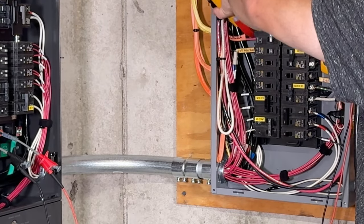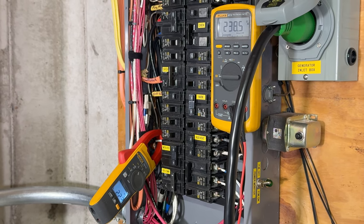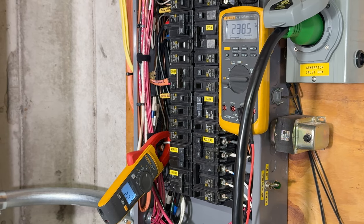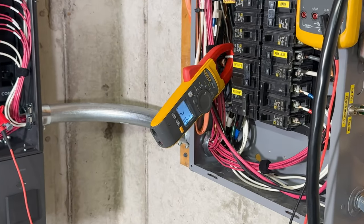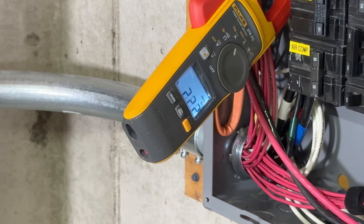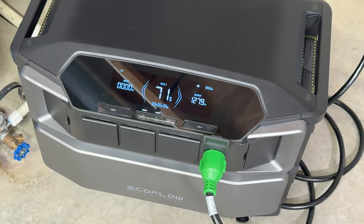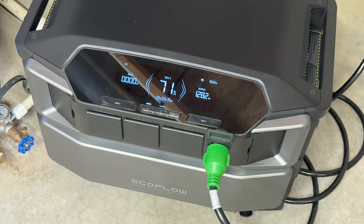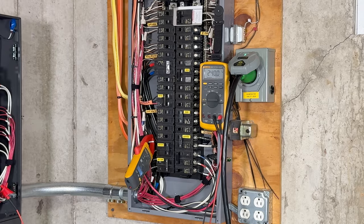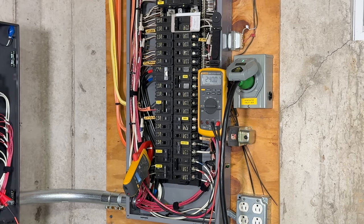As far as your actual water heater. All right, there we go. The water heater just kicked on. You can see we dropped to 238, which is very respectable. You can see our amp meter down there at the bottom. We're running right at 21 amps, 22 amps. Jumping back here to the DPU, it was running 6,500. For some reason, it's cycling it on and off. I don't know why. It's an electronic control. There it is, 6,400 watts. It's holding really good on the actual voltage.